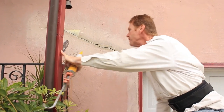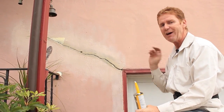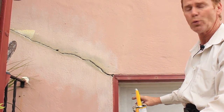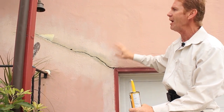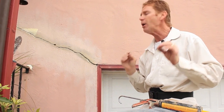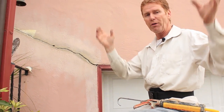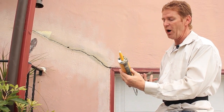Another cause of cracks is vibration. This door here is new, but it used to be a wood door — you'd open and shut it and that shakes the house and cracks it. You ever notice in older houses with the lead weights in the windows? You open and shut them and the vibration causes cracking big time underneath and above all of those windows.